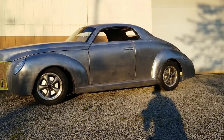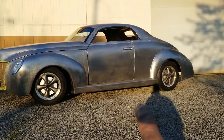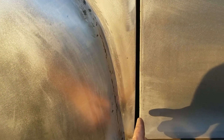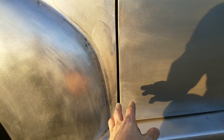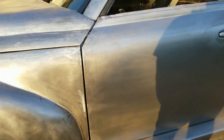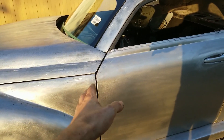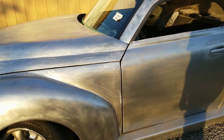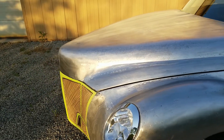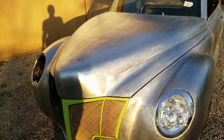You can see how well the integrated rockers worked - the rear fenders are blended right into the rocker, but at the front there's a bolted flange and a seam, and you can see how well it's all finished off. These fenders have to come back a little bit - they're out past the rocker slightly, so we'll move it back about a sixteenth of an inch to close the gap down to a heavy three-sixteenths - enough for primer, paint, and clear coat. When the fender comes back, the hood will come back too to close that in.